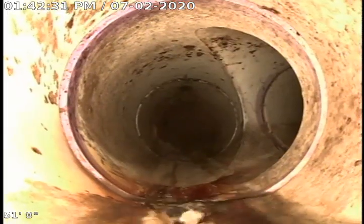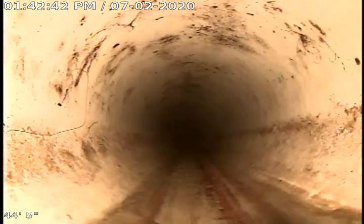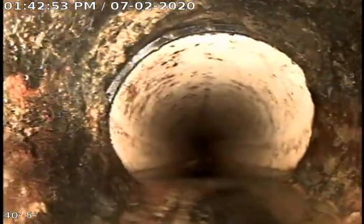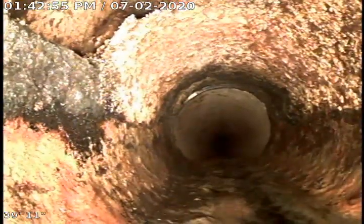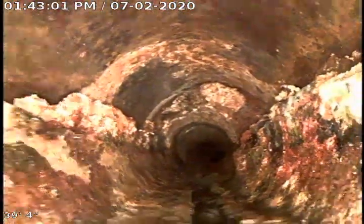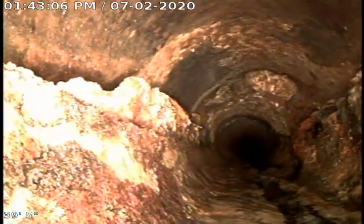The main stack is probably to the right there, coming down. Right here is the transition from PVC back to cast iron. You'll notice the top of the pipe — the cast iron is gone. This is pushed into six-inch clay. Recommend having this taken care of and getting this out of here. I'm going to go ahead and mark this spot.